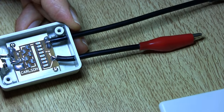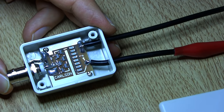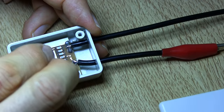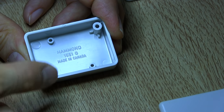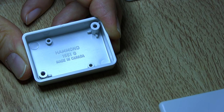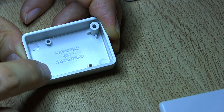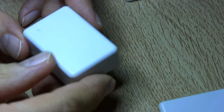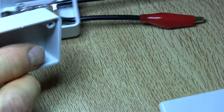This isn't intended for high frequency use — anybody in the RF game will know that because of the long clips and lead inductance. I primarily use this for IF alignment and lower frequency use. These two screws mount the circuit board to two smaller extrusions in the box. When I got this box it didn't come with smaller screws for those extrusions, so you'd need to find smaller screws. It is a Hammond 1551G — that's the box number. I've made a few of these for friends with spectrum analyzers as well.